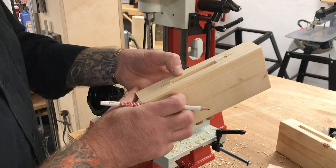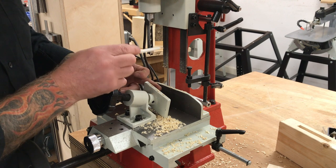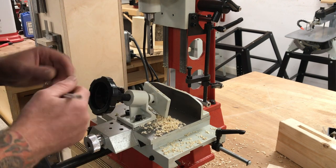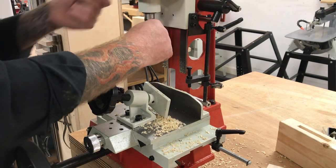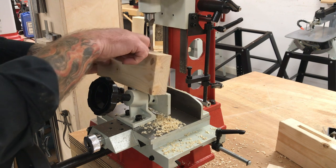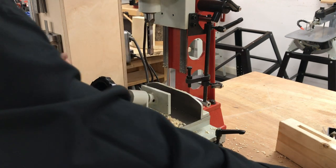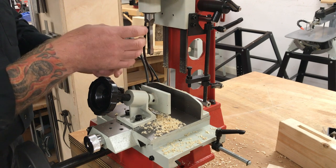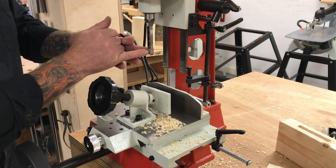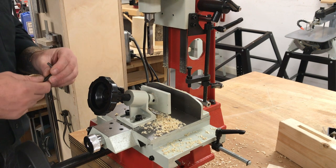So that's the basics of hollow chisel mortising. Make sure you get your back face square to your fence and the waste has somewhere to eject to. Whether you work left to right or right to left doesn't really matter. What is important: when you're plunging deep into your mortise, a lot of the window gets covered up and the waste can't escape as easily. It gets stuck in that area, a lot of heat and friction builds up, it starts to go blue and brittle, and I've seen these chisels split and auger bits snap. The smaller the chisel, the more vulnerable you are.